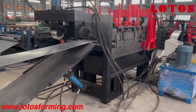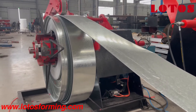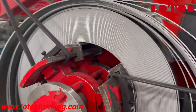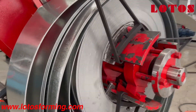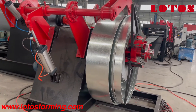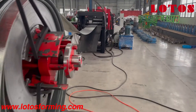The first stage is the hydraulic decoiler. The expansion is hydraulic, the unwinding is motorized, and the press-on is pneumatic with a cylinder. This is the complete upstream line: we have the hydraulic decoiler, servo feeding, and leveling unit with pre-cut.